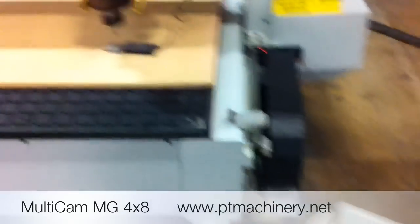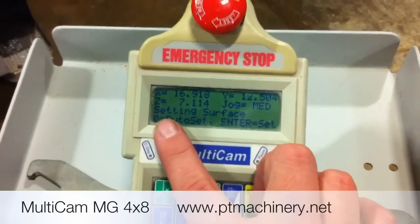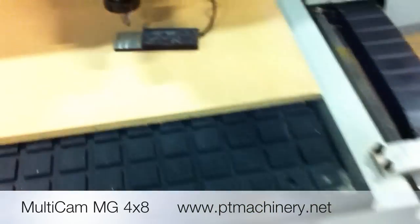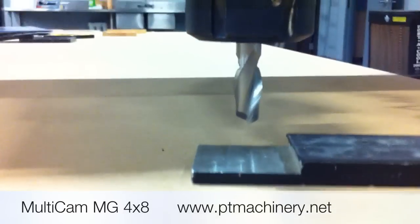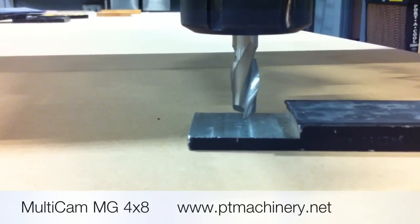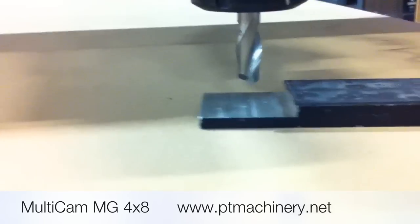From the keypad, I'll simply hit the set surface icon right here. As you can read on the keypad, it says setting surface zero to auto set. I'm going to hit zero and quickly come over here for a closer look. The machine is very quiet as it moves slowly down towards the tool touch-off device. When it gets there, it should retract automatically. That tool length is now saved in memory and the machine has been calibrated.